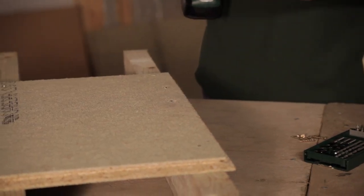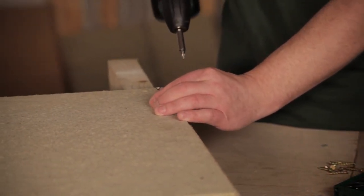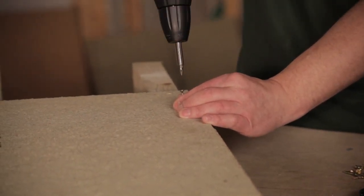I've got a piece of loft board. What I'm going to do is show you the loft board going down onto the actual rafters — we're going to screw it down onto the rafters. I've set the drill on its lowest torque setting. Put the screw in and then screw into the timber and down into the joist.